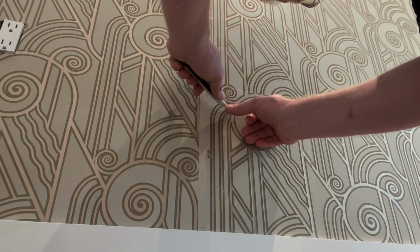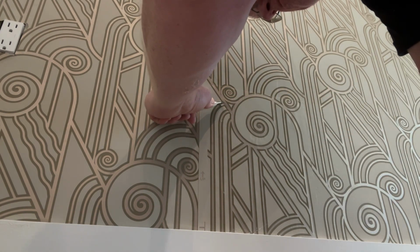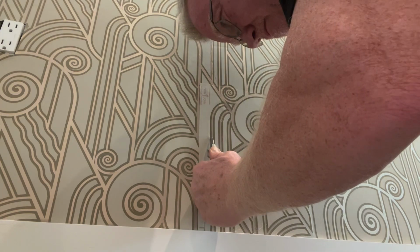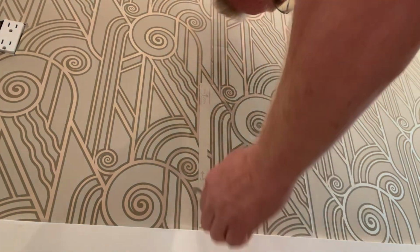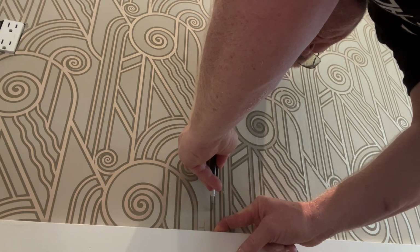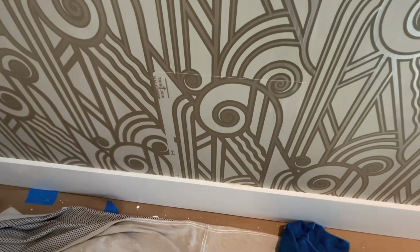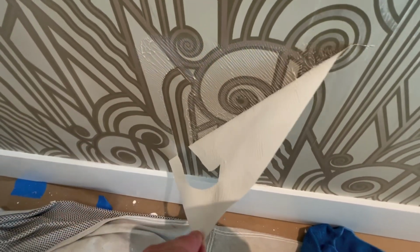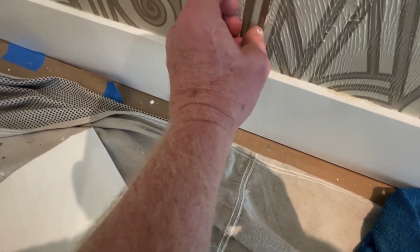And so what I'm doing here is eliminating a very ugly piece underneath. This wall covering was almost perfect. It came with some discoloration, which the homeowner took photographs of in order to document if the error repeated itself throughout the sheets. And so all I'm doing is removing something that was very ugly underneath it. It could be a tear, or it could be a discoloration of the pattern. In either case, you may want to simply splice it rather than waste an entire 2 feet of the wall covering.